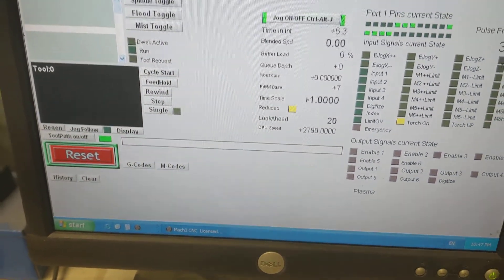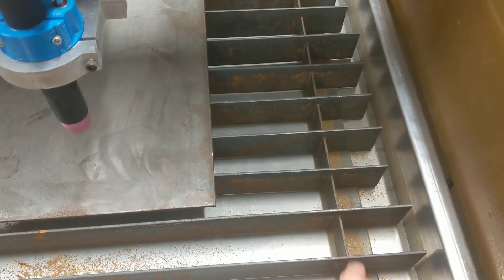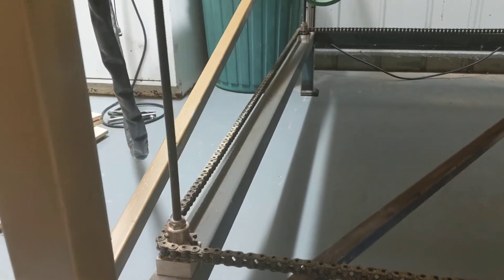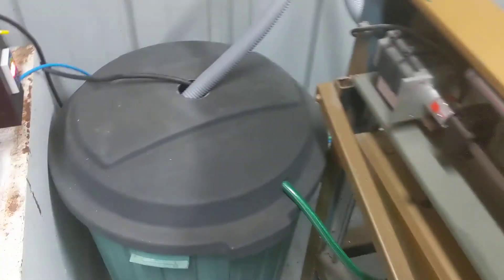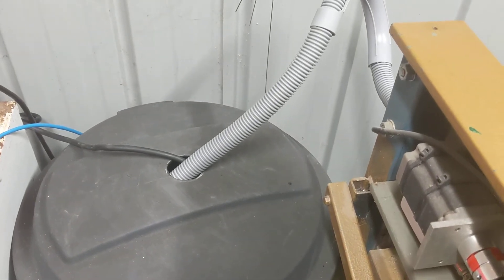My next step is to fire this thing up and see how it goes. I'll show you the rest of my setup. I've had a tray made — a big tray that holds about 75 liters of water, with some angle iron and slats that sit on top. The whole table sits on these rods, and if I turn the motor on at the back I can raise or lower the whole table depending on what I'm doing. For water, I've got a big 75-liter bucket here that drains through a little tap, and an Azuto pump fills the whole table in about one minute.